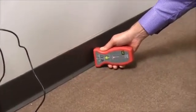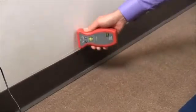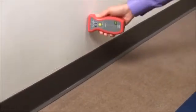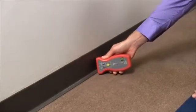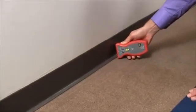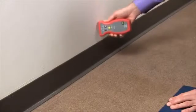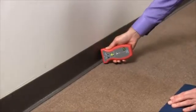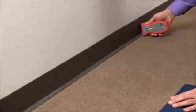You can see that it's along the floor that it appears we have the wire. So we'll go along the floor. And if you were ever to lose it, you will have to go in a circular fashion to try and find it. You can see that it's going along the floor. Every few feet you'll want to stray off of that just to verify that we actually haven't lost the signal and that it is a true signal we have. You'll continue as long as you need to trace the wire.